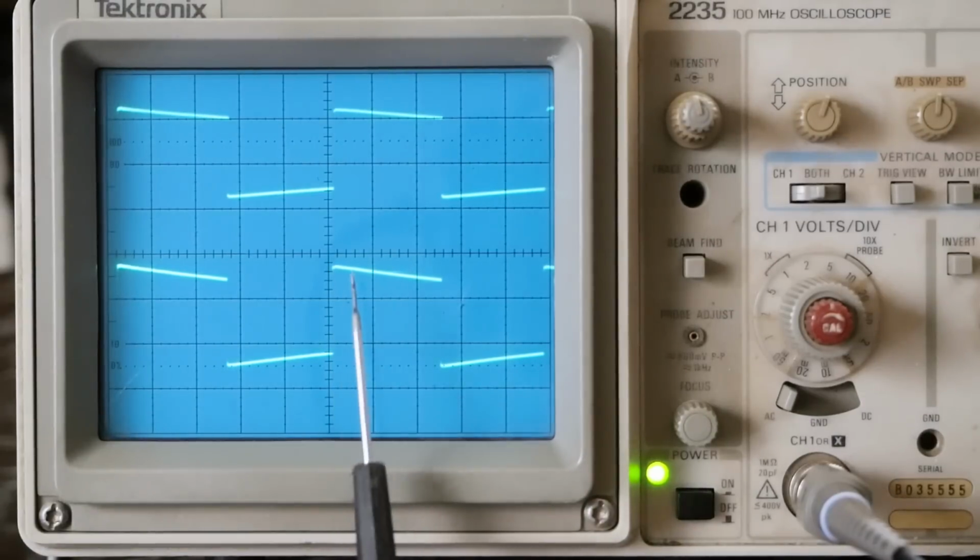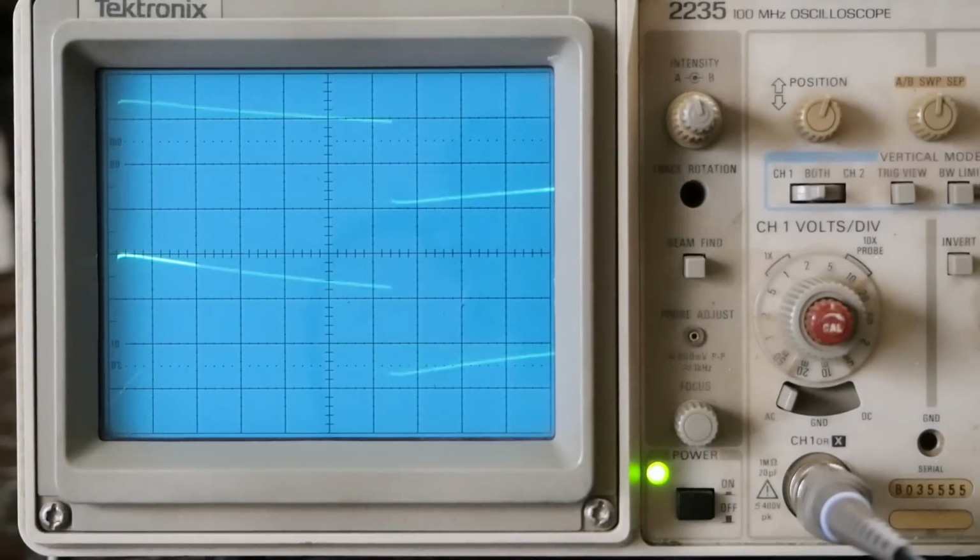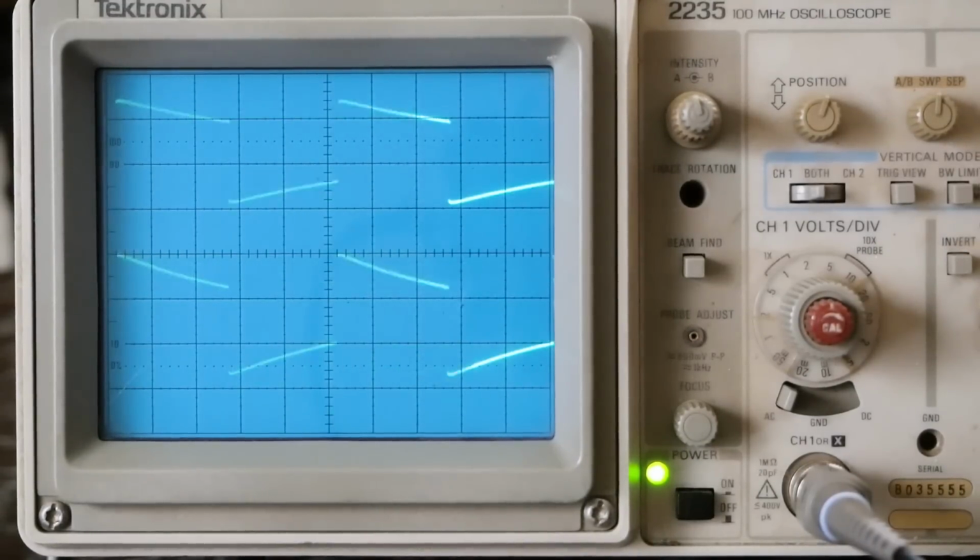So let's go down to 100 hertz, see what the square wave looks like there. Okay, so here it is on 100 hertz, and I'm not surprised to see the bottom end rolling off a little bit like this. This isn't uncommon on a tube amp, and I'm sure when we put it on the audio analyzer suite, we're going to see it roll up a few dB on the bottom end as it comes up to the frequency response curve. But we'll see that better on the audio analyzer suite when we run that on it. And so let me lower the frequency down. There's 40 hertz. And we see it even more pronounced. But that doesn't really shock me. A lot of my amps that I've built show this when you go down on a square wave into the lower frequencies testing it. And that doesn't concern me at all.